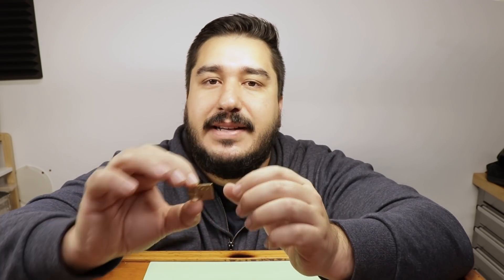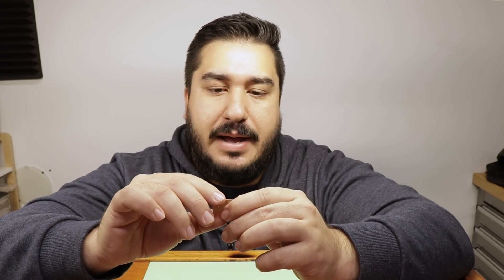I think that as long as this hole is perfectly centered, there shouldn't be any issues because the alignment pin locations can't change — it's fixed, it fits, it doesn't move side to side. This is an ongoing experiment; I'm testing new methods. I wanted to make this the fastest way possible, and I feel that it may be accurate enough. I'm going to find out soon enough, and if that's the case, in the future I'll probably try to create some sort of drilling jig to create these holes initially and just speed up that process.